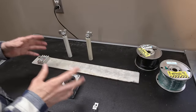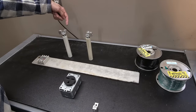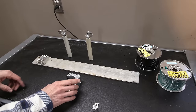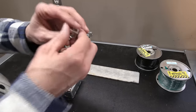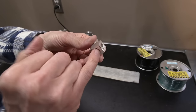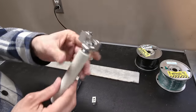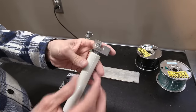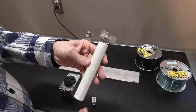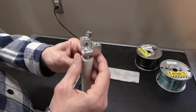Okay, here's the plan for the generator side of things. So the generator will come into these two posts, and these two posts here will break off into the relays and the sockets. So I picked up a whole bunch of these lugs right here. As you can see, they hold some pretty big wiring. And there's two of them together on the top of this porcelain standoff. Now these standoffs come out of big old transmitters, and they're used to having kV across them, so they're absolutely fine. So these will be tightened together with this nut here, so it'll make these nice and tight.